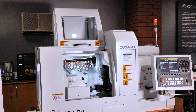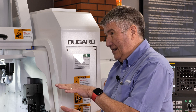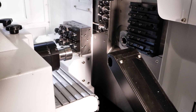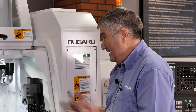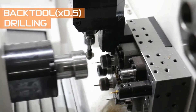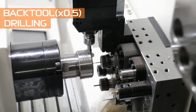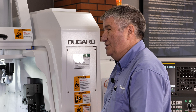The 10mm machine is for someone who has a particular range of parts that fall within this machine's capacity and wants to optimize output for that size of part. With chip control and the rigidity of the tooling in this machine, it enables people to push things to the extreme — eliminating vibration, which is what sliding head gives you because of the close proximity to the supporting guide bush.